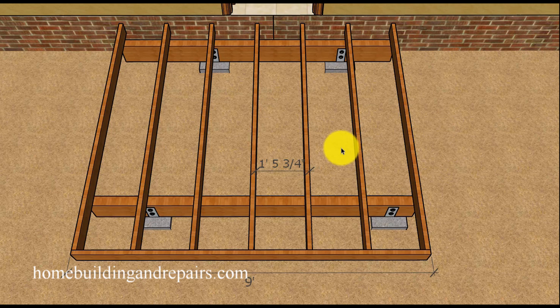Think about this when you're designing your deck and think about it when you're building. Instead of leaving that last bay at 10 inches, you can simply reposition the same amount of joists or add another joist to the deck to make it stronger. So let's make your deck a little stronger by either adding a few more joists or at the very least positioning and centering them to where they are going to create a stronger deck.